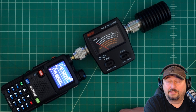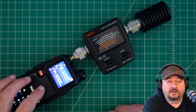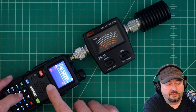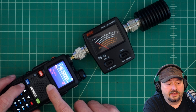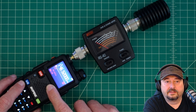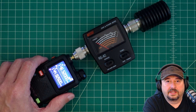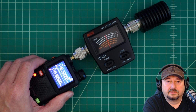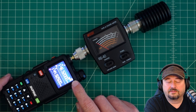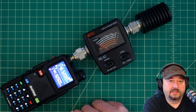That's eight times higher than the rating. It's not really a problem for me, but if I was the type of person who did want a lower power radio that might be something to consider. Now I'm going to enter the menu, hit number two to go to power settings, adjust up to middle, and exit out. This rating is three watts, so let's key up — and that's close to five watts. We don't have a fully charged battery but it's close, so again it's higher than what it's advertising for medium power.